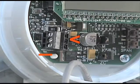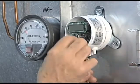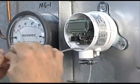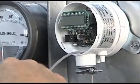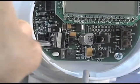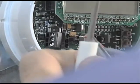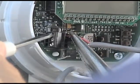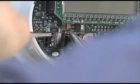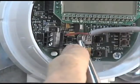This is labeled TB1 on the circuit board. Bring 16 to 22 gauge wire up through the electrical entry. Note we are using a half-inch conduit adapter to connect to half-inch conduit for final installation. Wire properly per local wiring codes. With a small screwdriver, loosen each screw on the electrical block. Slip wires into the appropriate connector on the terminal. Each connector on the terminal block is properly identified on the circuit board. Tighten until wires are secure. Check the wiring diagram on the installation manual provided to wire properly per the model and output you are installing.